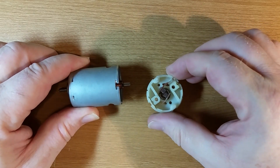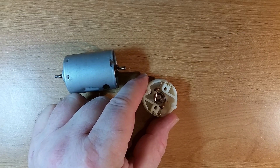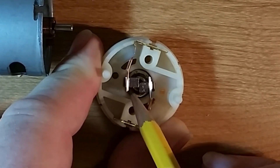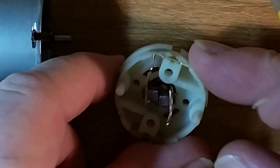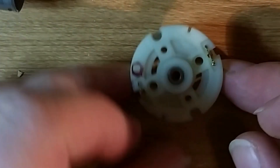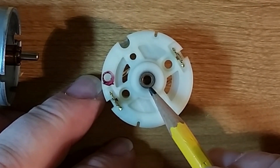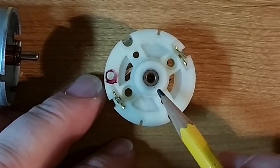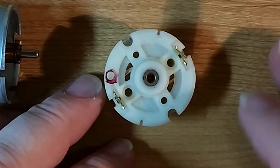The first things you see are the motor brushes, which contact the commutator, make the electrical contact, and send the current through the wires. In the middle of the backplate there's a bronze bearing — that's what the motor shaft rides on. It's a plain journal bearing, possibly oil-impregnated with a little grease, but there are no ball bearings in this particular motor.